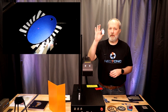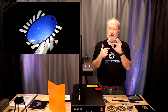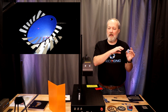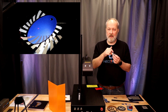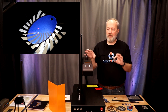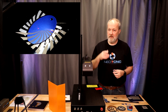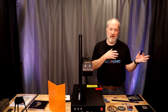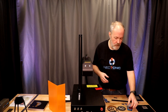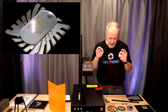I love these bright blue aluminum tags. I put a swirl pattern on one and it turned out fantastic. You'll see in the video that the swirl pattern is actually larger than the piece itself — you gain speed on the creative side but lose it on the process side because the laser is processing beyond the part boundary. If you want, you could model it precisely in Illustrator so the laser only works on the actual part, but it'll work either way. It's just a function of time.